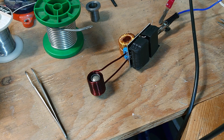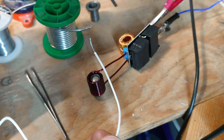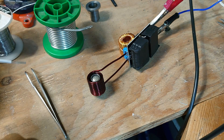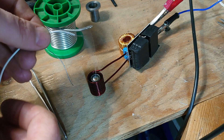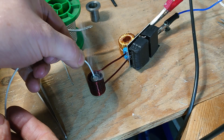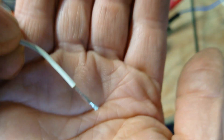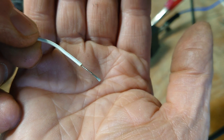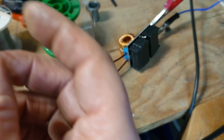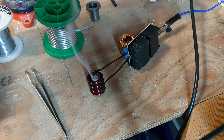The other thing I'll have to get is some flux so that the solder flows nicely. Let's just — oh, it's still liquid actually. Instantly tinned wire, if I can get it to focus. End splayed out but that's just because I fluxed it up. Oh right, that's getting a bit hot.